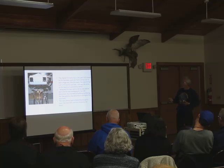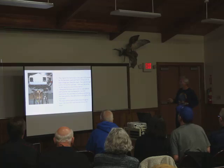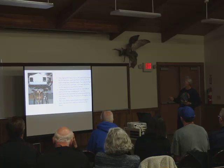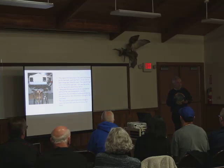So we kept the camera pretty much the same. You know, large parts of it were copies of the Mars 98 Pathfinder SSI. But instead of an image that had 256 by 256 pixels for each eye, we had a 1K by 1K CCD. So the field of view was the same, but we had 4 times the resolution.